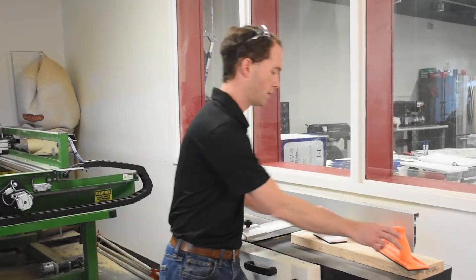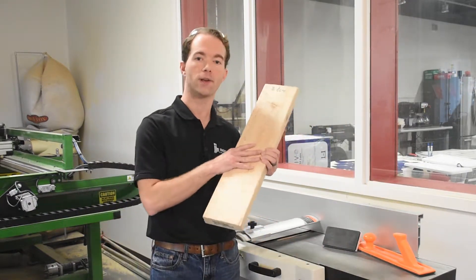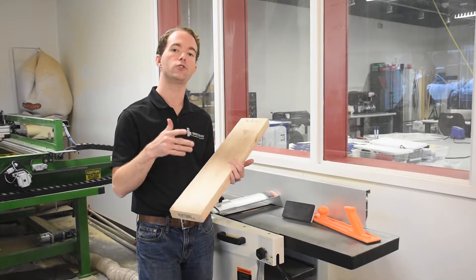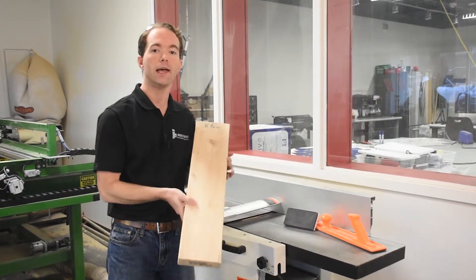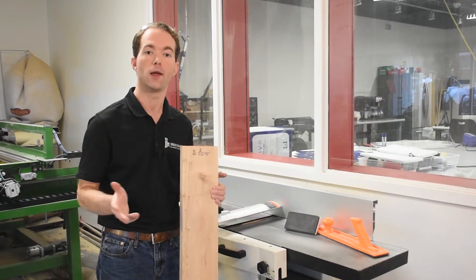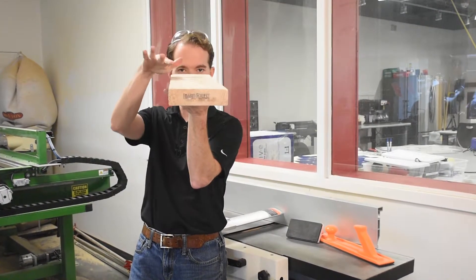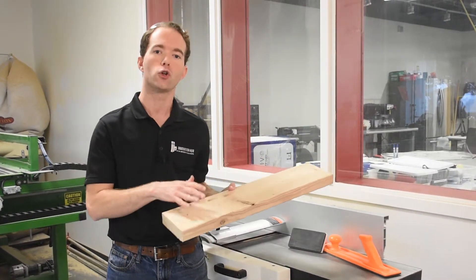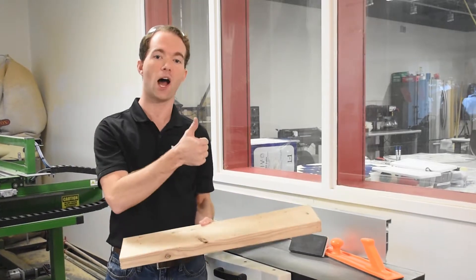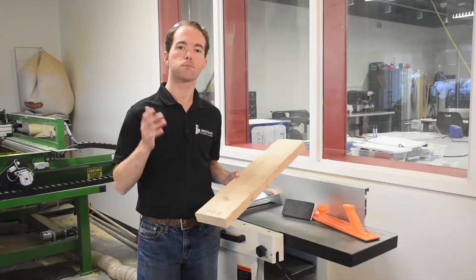For this demonstration, I'm going to take this two by six and turn it into a nice piece of dimension lumber. I first need to get a face flat, and this is where the joiner excels. It can be used to straighten crooked wood. And when you look down a piece of wood, you can see that it's bent a certain way. The convex side is called the crown. When you're running the joiner, you always want to do it so that the crown faces up. This is so that the wood doesn't rock back and forth on you. Let's go over to the whiteboard and I'll explain what's going to happen.